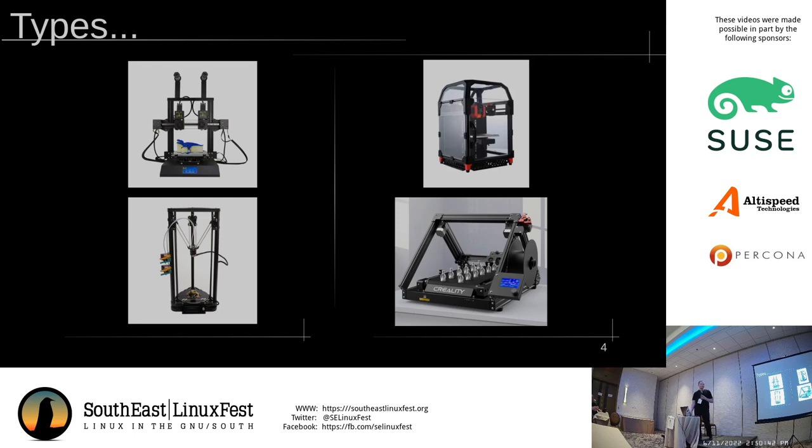We also have the delta printer. Delta printers have extremely lightweight printheads, so they can move the printhead very fast — they're good for speed printing. Unfortunately, that light printhead means you're limited in what kind of extruders you can use. The other disadvantage of the delta is that giant triangle of drive beams requires the printer to be about twice the height of its build volume, so they take up a lot more space. And then for more niche applications, there's belt printers. Belt printers are not what you should use as a main printer — they have their own trade-offs and tend to have adhesion issues. However, for the things they can do, they're the only thing that can do that.